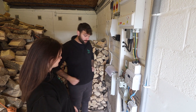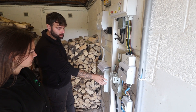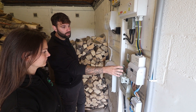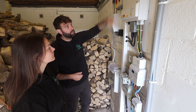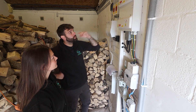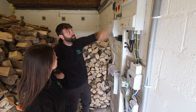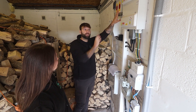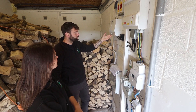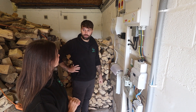So we're at the start of the system here. We've got the incoming mains, we've got split phase — a three phase head and we're using two of the phases. It then goes into the smart meter and into the split consumer unit board, so L1 and L2. We've taken our power off each fuse board into an AC isolator to turn off easily, and then we've got the inverters over in the other room. We've also got EPS boards here for power cut situations.